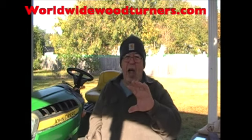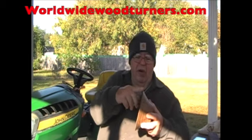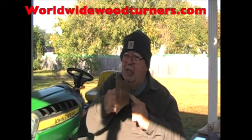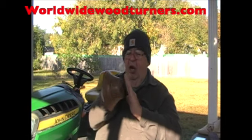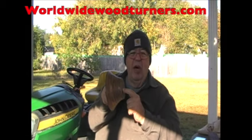But I want to hold the block of that, so I'm going to cut it to the round, drill my hole for my woodworm screw, and then, this is the other piece, right? Then I'm going to hold it on the woodworm screw, bring my tailstock up, and that's real important, until I get it round. And then I'm going to flatten just the bottom, right down here. So if I don't get all the way to the middle, it's okay.